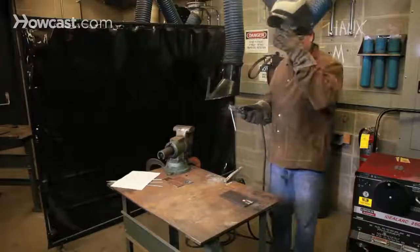You'll notice that the tip of the welding rod stays very near to the arc puddle and that I'm also slightly wavering the tip of the electrode back and forth. The idea is to heat both pieces of metal evenly as the filler rod is being deposited.